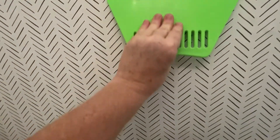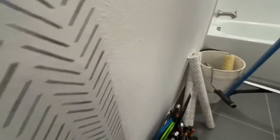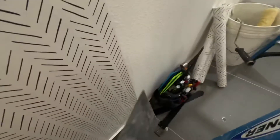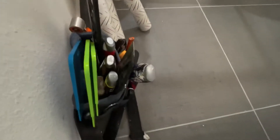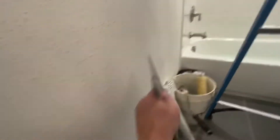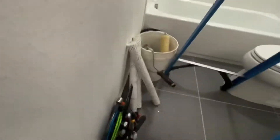Wallpapering over texture — does that give you the heebie-jeebies? Well, it takes a little extra finesse to install wallpaper over texture. Before you hang the paper over texture, you're going to take your scraper and knock off the points. Believe it or not, if you don't think there were points on your texture, look on the floor after you do it and you'll see them very clearly.